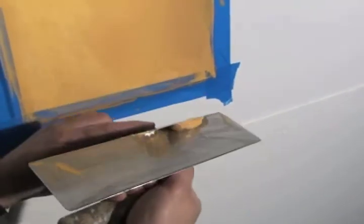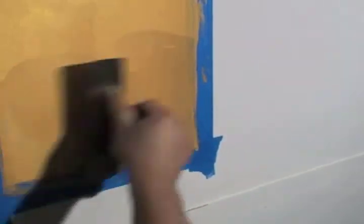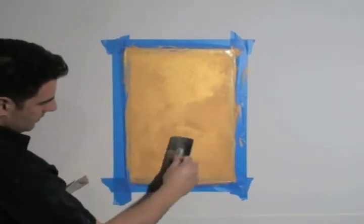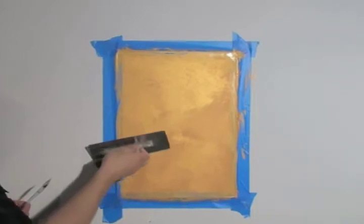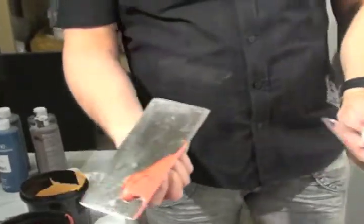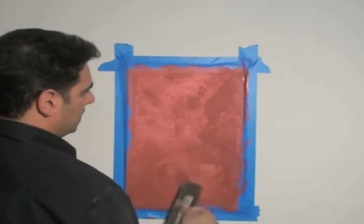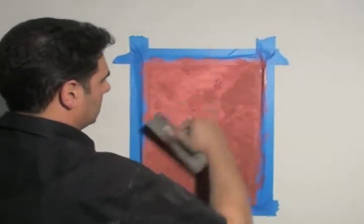For more control when applying Pearlas Velvet, reposition the material with the spatula onto the blade of the trowel. This is an absolutely gorgeous golden, velvety suede metallic finish. Notice the rich and matted brilliant gold throughout the finish, which is easily created with the movement of the trowel. The red base is absolutely stunning, even when untinted. A key to applying Pearlas Velvet is using a trowel that is free of imperfections on the blade. Chips or dents can cause scratch marks.